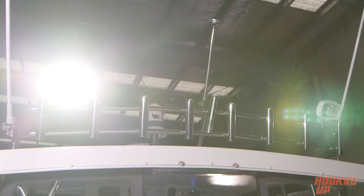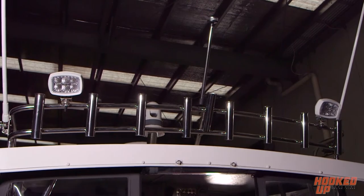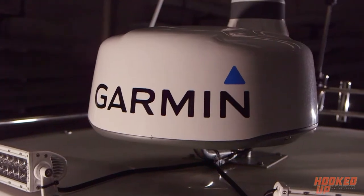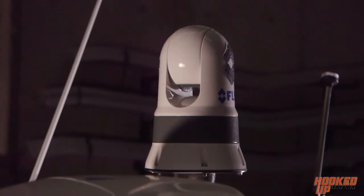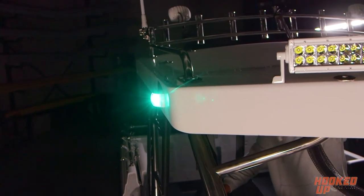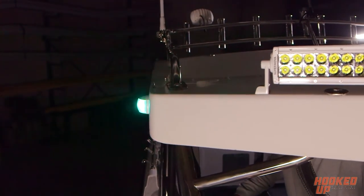All the lights are on a switch panel up top, and we just wanted to neaten up the dash and get everything up high. In these Strowns, because of that lift-up section into the cabin, you do not have a lot of dash room, so you've really got to work to make the most of that. Up on top it's housing the rocket launchers, anchor light, the aerials, Narva floods which are really handy when you're snapper fishing, and then you've got radar and FLIR. We've also put the nav lights up on top — other boats you get reflection from nav lights into your screens, so we've mounted them up at the top as well, which makes you more visible to other boats.